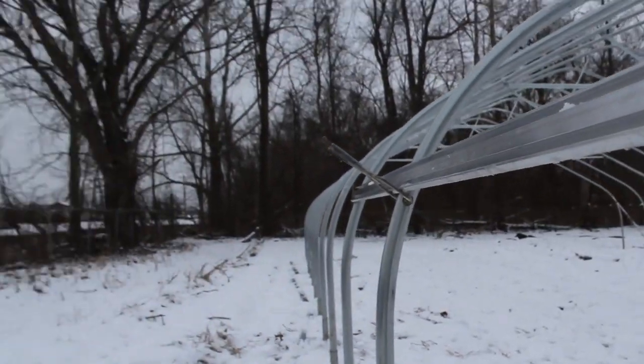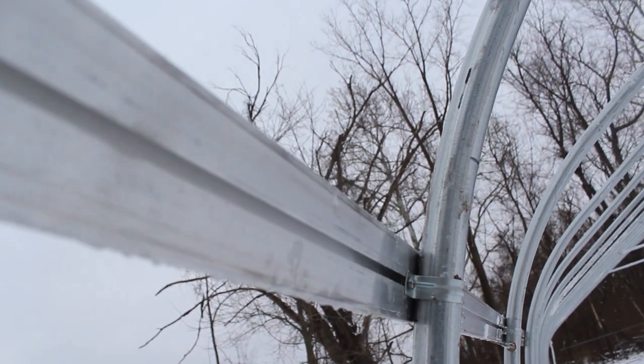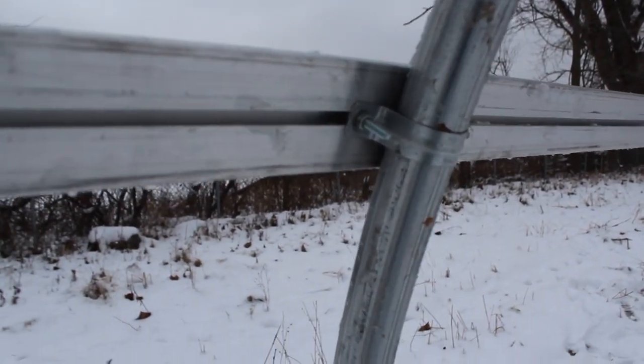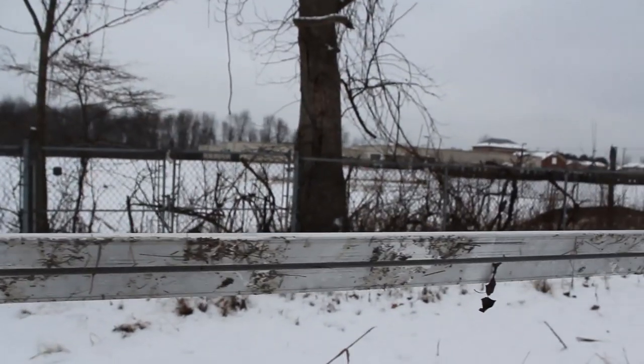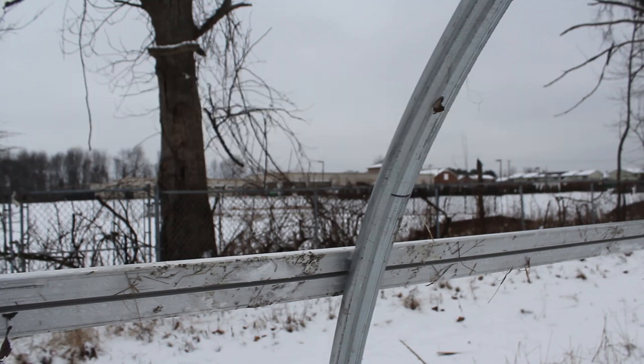Once that's in, we're going to take a look on the inside — you can see that the two-hole strap has been pulled flush against that hip rail, making it nice and tight. After that two-hole strap is secured, it's time to move on to the next one and repeat the entire process, making sure it rests on the line and the hoop is plumb before you tighten it down.